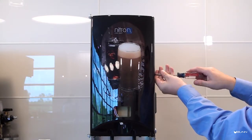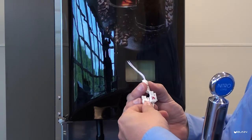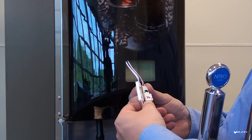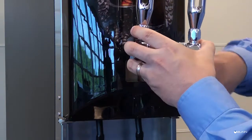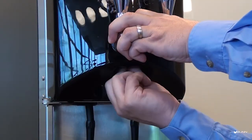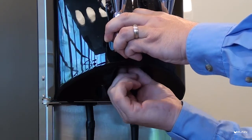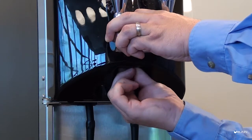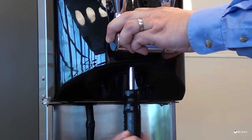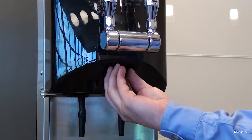With the door installed, connect the switches from the handle set to the wire harness on the door. Now install the handle set using the 2 screws on the bottom side of the handles. Finish by snapping the plug into the hole beneath the handles.